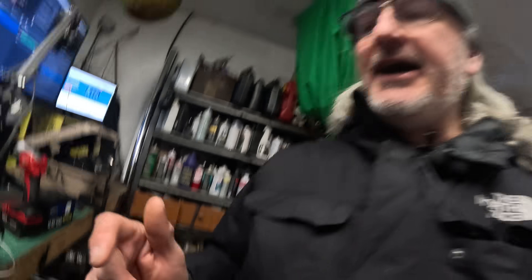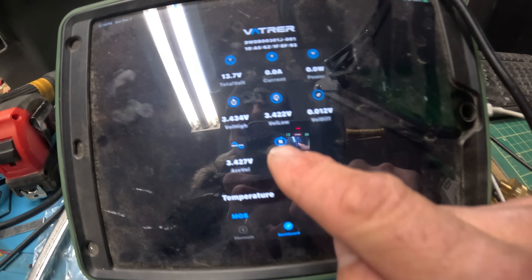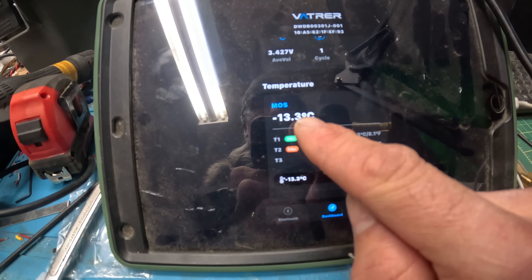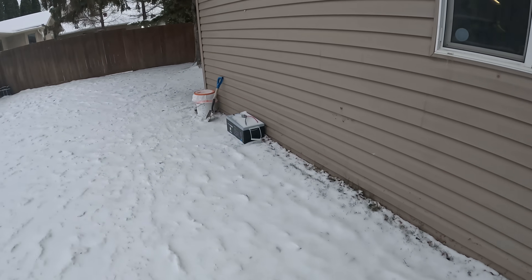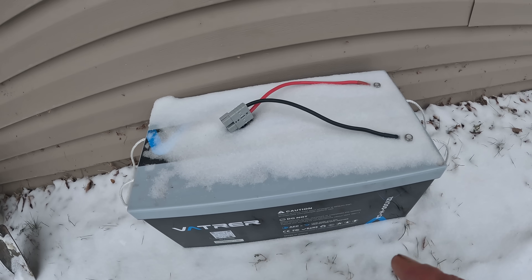The test is done. The stats on this battery are still showing 100% — kind of weird because now it's 13.7 volts and the temperature is still reading minus 13.3. We're going to go outside and check out this battery. That means the 90-watt internal heater was keeping up. This battery is designed to shut down when it gets below minus 20 Celsius to protect it. Obviously the 90-watt heater was working, and there it is right over there. It seems to have kept it warm enough so it would still work. This is a perfect battery for an ice fishing shack or somewhere where you have a remote station where you need power on when it's cold. It didn't really affect the voltage too much — it's still showing 100%. This thing could be left outside in the minus 30.